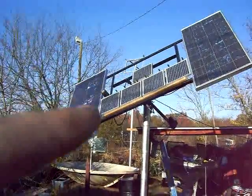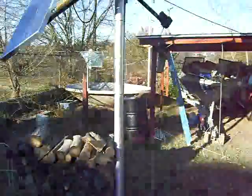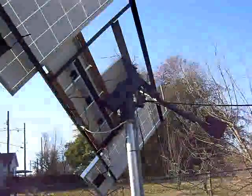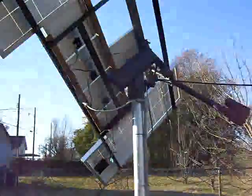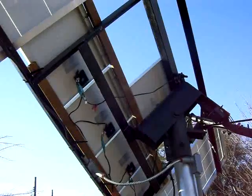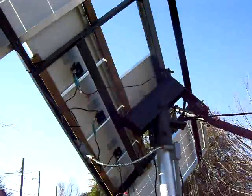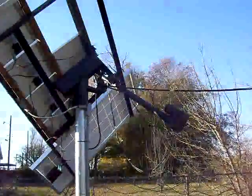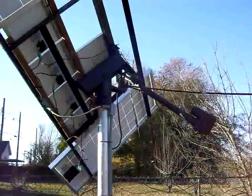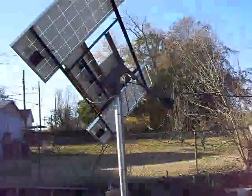That's the little black thing over here, and that's the sensor that watches the Sun. I used a three-inch pole and an old C-band satellite dish mount — I modified it a little bit. I cut out the little circle that was there and welded an inch-and-a-half by inch-and-a-half L-metal stud, using the motor from the satellite.